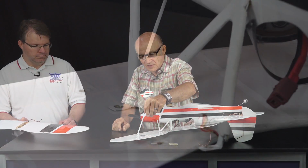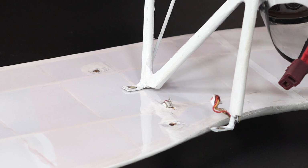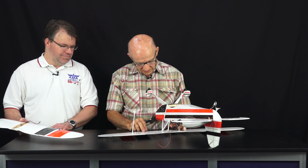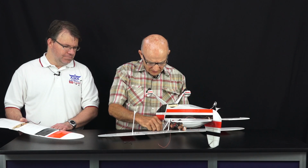And the bottom ones are the same, except it has like a slot where you just slide it down in behind the washer. So kind of sort of works. You got your screw there. Yeah. These are actually just 4-40 by 1/4 inch socket head cap screws. And I never found a nylon screw that would shear when you want it to anyway, so.